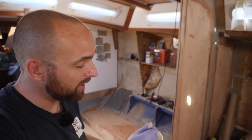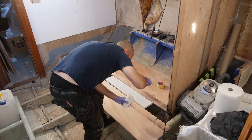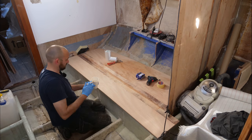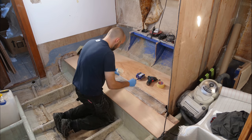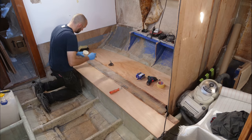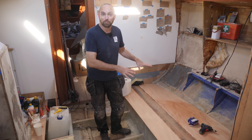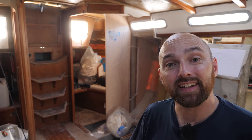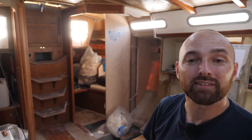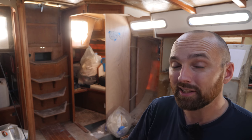For joining the two pieces of plywood together, I'll use a glass butt joint — you guys have already seen me do that on the bulkhead, so no need to go into too much detail. That is basically perfect. I'm going to let it cure overnight and then tomorrow we'll flip it over and repeat the process. It's 8 o'clock at night, but for once it's a nice warm day and I want to take advantage of that because I still need to tab the forward-facing side of that bulkhead to the hull. I figure I'll be done sometime around midnight, but it'll be really good to get that checked off the list.